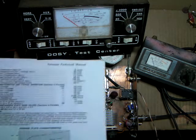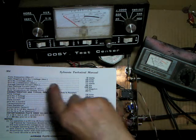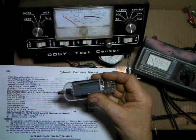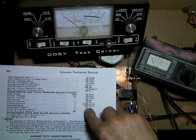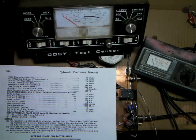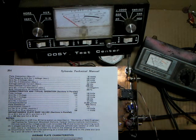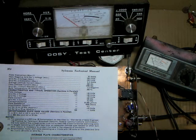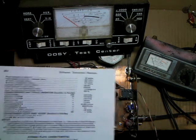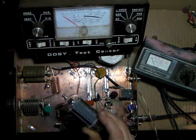If you were going to use two of these tubes, that 4,000 ohms becomes 2,000 ohms — the plate resistance halves when you parallel two tubes. A pair of these would give you a nice 100 to 150 watts pretty easily with about a 5-watt drive.